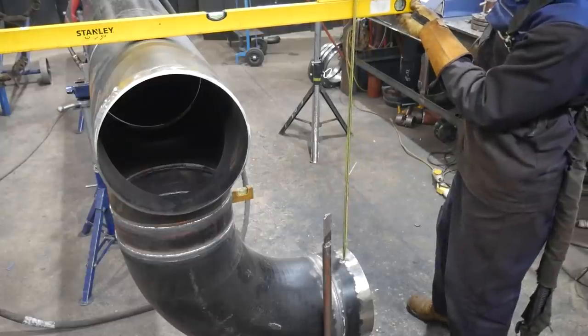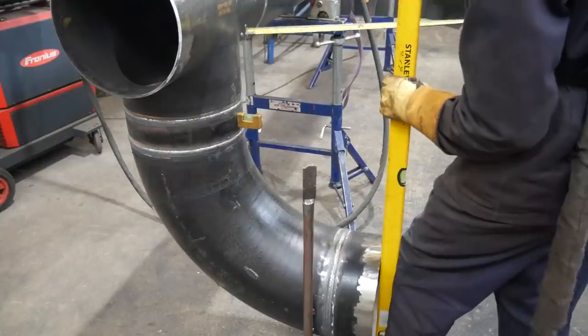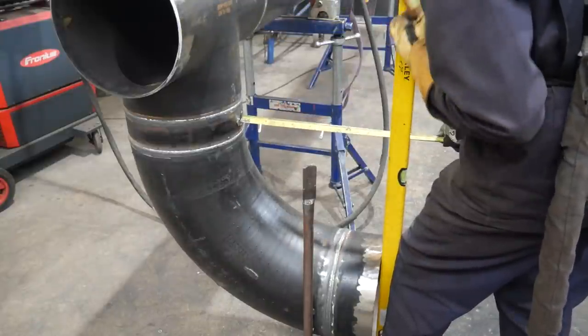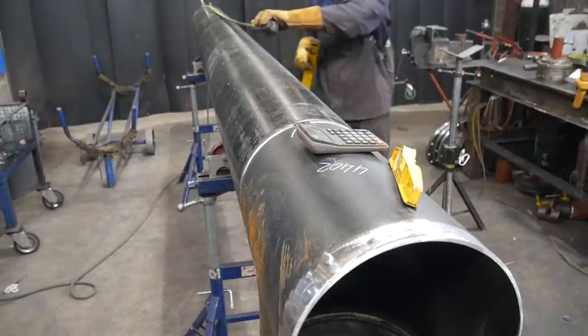This here is one of the more critical parts of the job, making sure you hang the flanges at the right amount. So I'm measuring a few spots and then I'm going to do the calculation so I know how much to hang the flanges on. And then I'm going to measure the overall. So here I'm writing down the overall measurement,